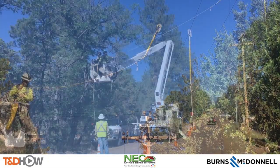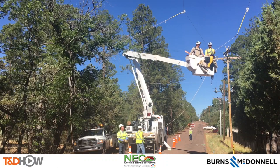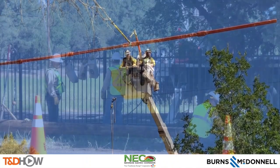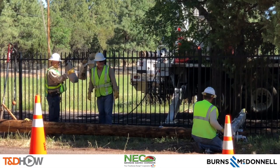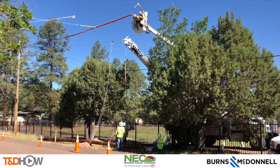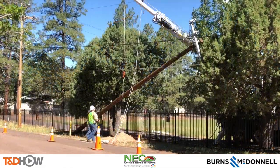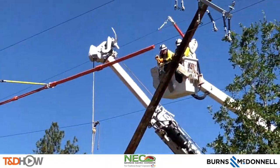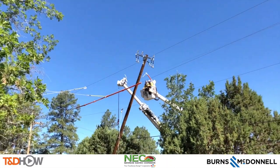Our first task here today is to spread the existing distribution lines, making room for a new pole install. Here we see them holding back one of the phases or lines with a jib on the bucket truck. Back on the ground at street level, they're framing up the new pole to be installed. Now they can swing around and use a derrick to pick up this pole and lift it into place, being careful to avoid any obstructions on the way up. You can see why it was important to spread those lines apart to give room for the pole to be raised into position.